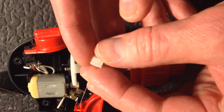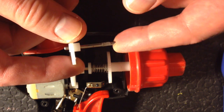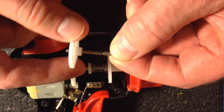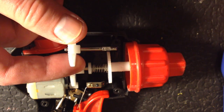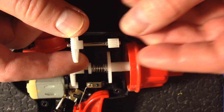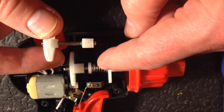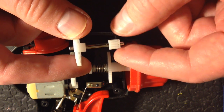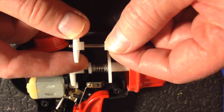So I'm going to have to do something about making a new one. What I plan to try is I'm going to cover this area here with some polymorph and make it round, roughly the same size as the gear. And then I'm going to lubricate this gear and try and get that gear to make teeth marks into the polymorph to make a new gear out of it.